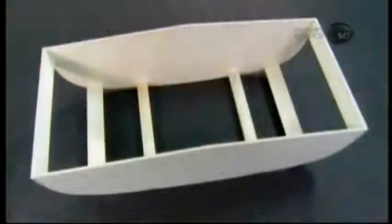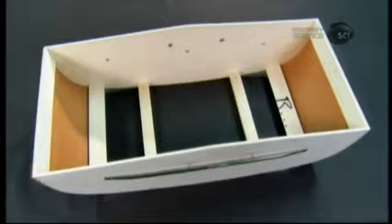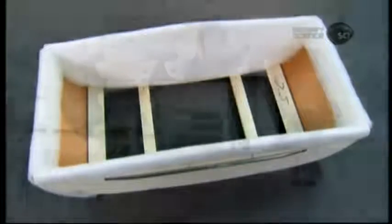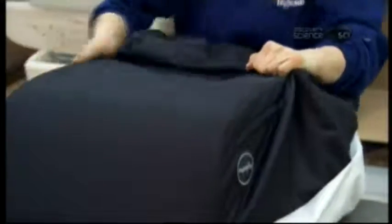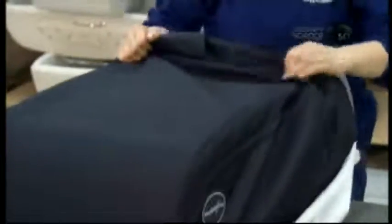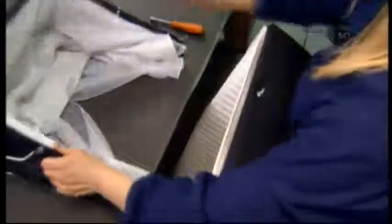The body's structure is made of plywood sides, poplar bottom supports, and sturdy fiberboard ends. After cushioning the sides and edges with polyester batting, they dress the body with the upholstered covering and lay in a cotton mattress. After installing metal carry handles, they affix the PRAM's canopy, driving the screws through the upholstery into pre-drilled holes in the plywood structure.